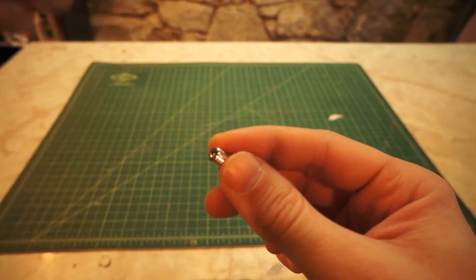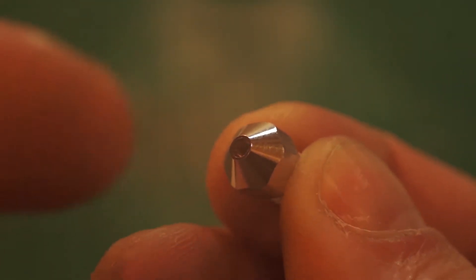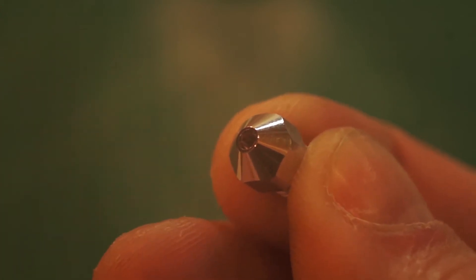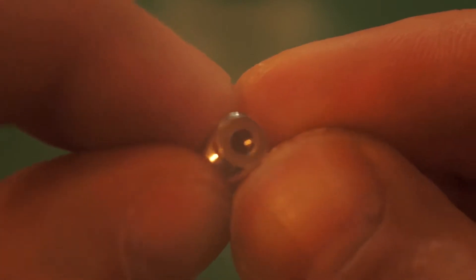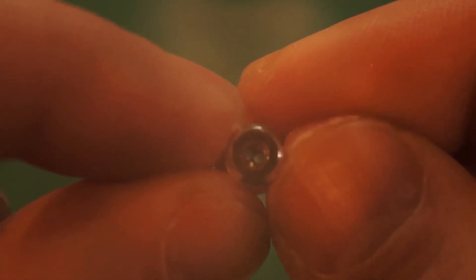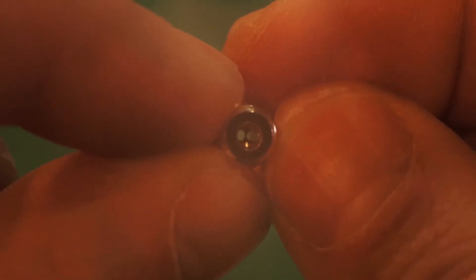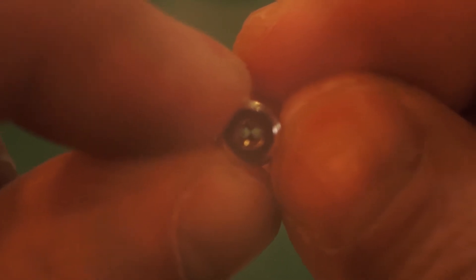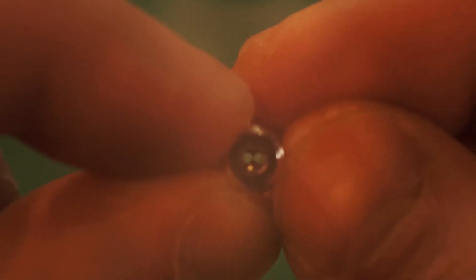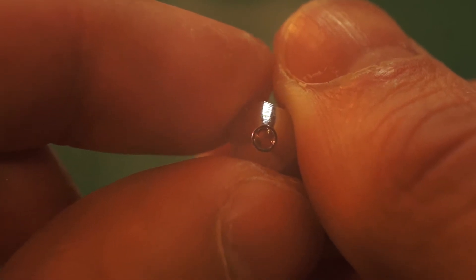Let's show you what's going on inside. Getting up close and personal to find out how we can squeeze out a gob of plastic that's wider than the plastic we're putting into it. This nozzle has an interesting detail on the inside: the path for the plastic is split in two. The plastic hits the hot end, hits the heater block, melts, gets squeezed into this split channel — my guess is to provide enough surface area to heat up the plastic — and then recombines into the thicker diameter on its way out the nozzle.